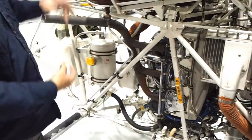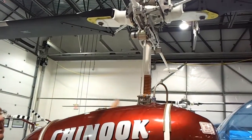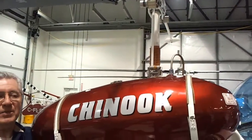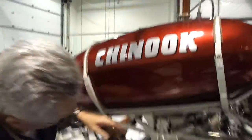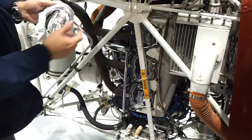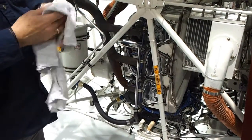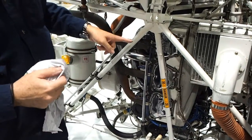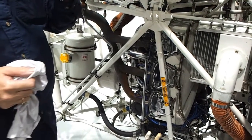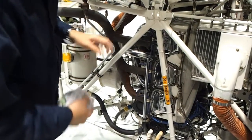Big pieces: main rotor head, mast, swash plate, transmission. In the transmission, the white thing is attached to the engine — a piston engine, six cylinders, three on this side, three on the other side. Each cylinder has two spark plugs. A car usually only has one spark plug; this has two.